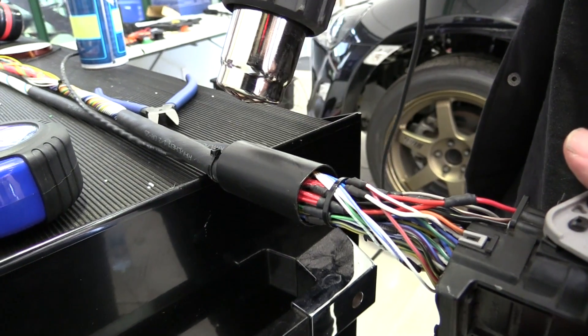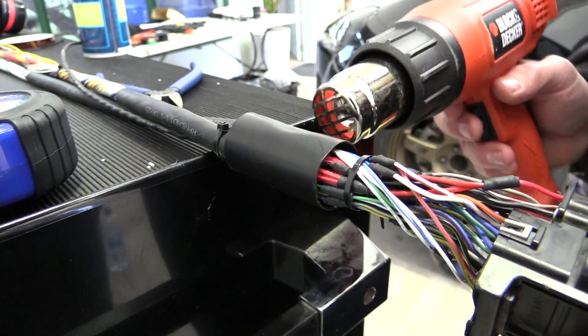However, this is also an expensive process when we have a lot of transitions to seal. In our harness we're using another type of heat shrink tubing called SCL. This is a semi-rigid glued heat shrink that helps environmentally seal the transition, and the semi-rigid finish provides strain relief for the wires beneath. Before applying this product, we wrap the transition in Kapton tape, which is a very thin tape able to handle high temperatures. Wrapping the underlying wires with Kapton before shrinking SCL or a molded boot onto them makes it easier to perform work on the harness later if required.